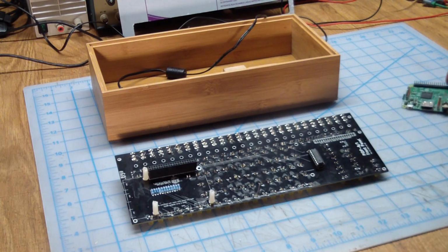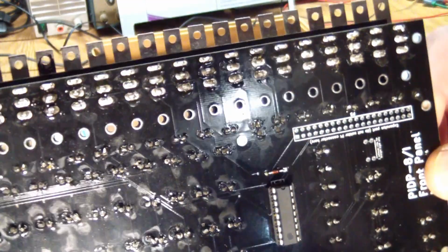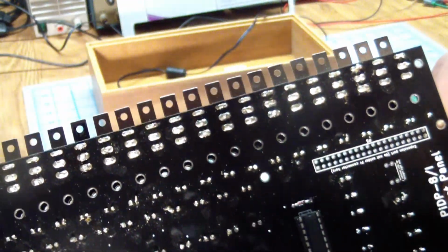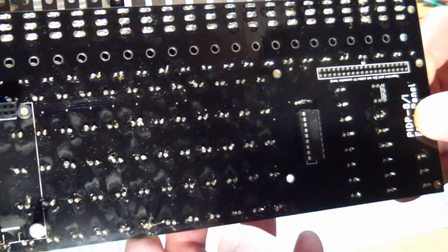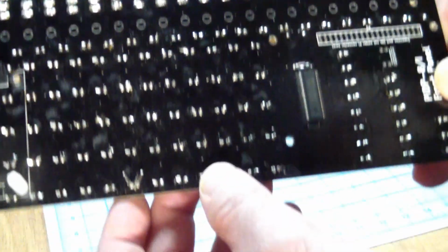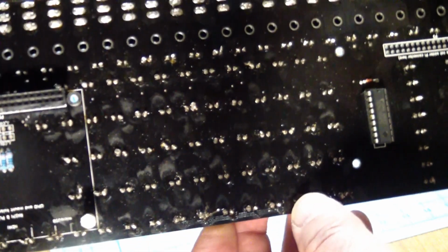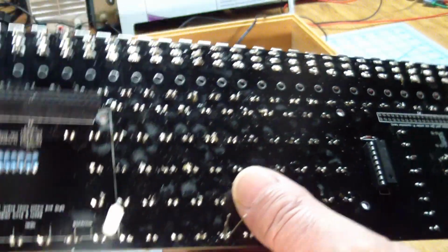One thing I did notice when looking on the back, the soldering on it is really bad. There's all sorts of flux residue, uneven things sticking up in the air, some things that look like they're not even soldered correctly, which means some of the leads are sticking through. Oh, of course, here there's 2 leads sticking out. So yeah, that's going to need some work.